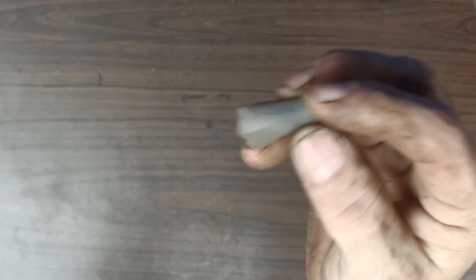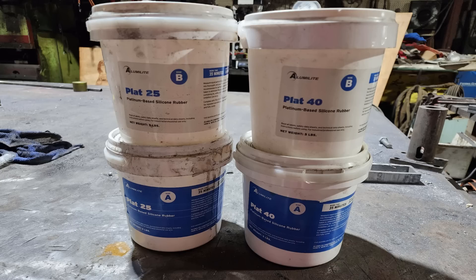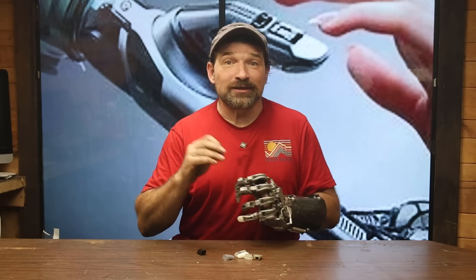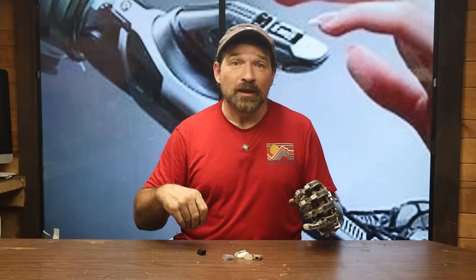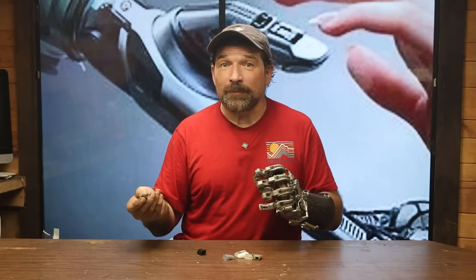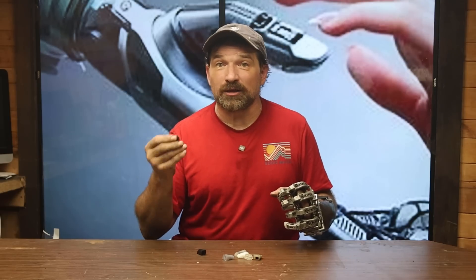I saw a bunch of comments talking about the overmold process I've demonstrated several times in earlier videos — where I take a 3D printed piece that snaps onto the metal tang of the finger, then use two-part silicone to cast the outer profile. This works pretty well for a while, but then I run into the issue where the silicone doesn't actually bond to the core. During normal use it'll stretch, and suddenly I find I've dropped one or multiple fingertips on the floor. Most of the time I don't realize soon enough to find them, and if I do, superglue usually only holds for a couple days before they rip or fall off again. For overmolding to be more successful, you need something integral to the core for a more solid mechanical attachment.